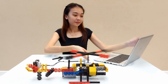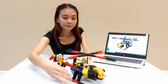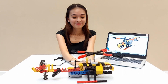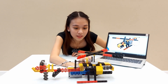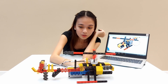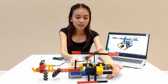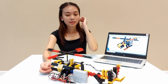You can see this is the helicopter that I've done — this is the outcome, and I have mounted it here along with the switch and battery. The DC motor drives the drive gear — this big gear is the drive gear and the crown gear is the driven gear. You can see it's rotating based on the flexible universal joint here, and all the movement transfers to the propeller, which is spinning as well. From the other side you can see the propeller gear and how it gets connected.